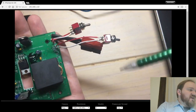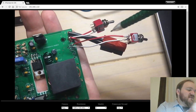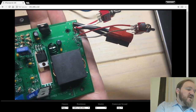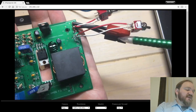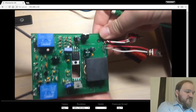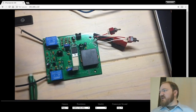So there's an option over here. I've only populated one of them, but you can do a single set of power poles in to provide, you know, your 13.2 volts from a single SLA source. Or you can throw this switch and have a second set of power poles here if you wanted to have two SLA type sources in parallel. And this allows you to switch between them on the fly. So that's the quick and dirty version of what the circuit is that we'll be working with tonight.